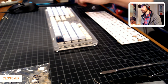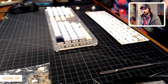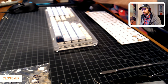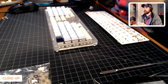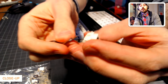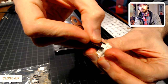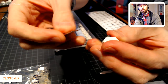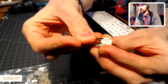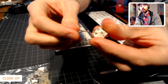So at first I was really nervous because I was like, how am I gonna do this 62 times or 60 times or whatever to make these switches? But I found two tricks that made this go pretty quickly. One was that instead of going in through the top holes like this and popping the switch out, I actually just turned the switch upside down and went under the two plastic tabs, like that. And that worked pretty well. I was able to pop both off pretty easily.